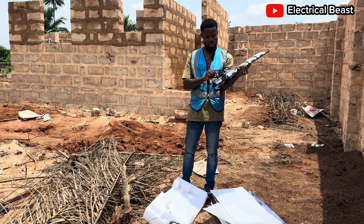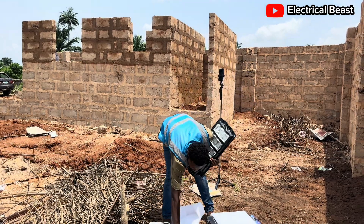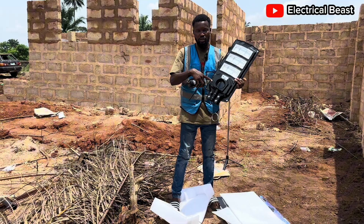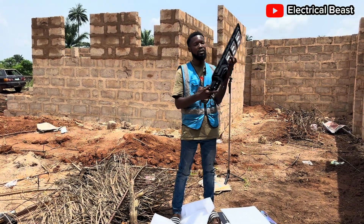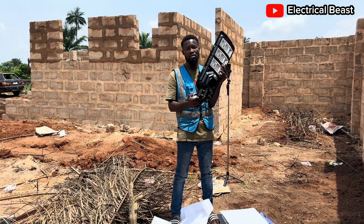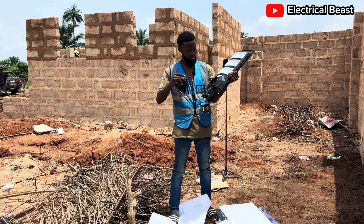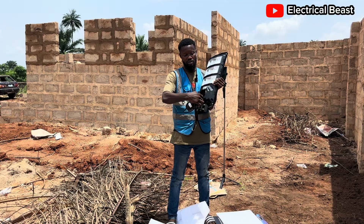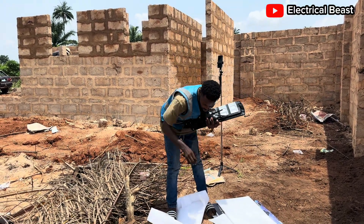For the entire setup it comes with a power plug for the camera. This is the point where you plug the camera to get power through the battery inside. The battery is big enough to power both the light and the camera. Then this is the panel that charges the battery inside, that eventually powers the light in the evening — the light comes on only in the evening. Then the camera works 24/7, because this is the button where you switch on the camera after connecting it through this USB connector. So that's how it works.